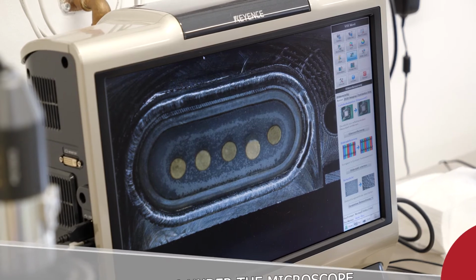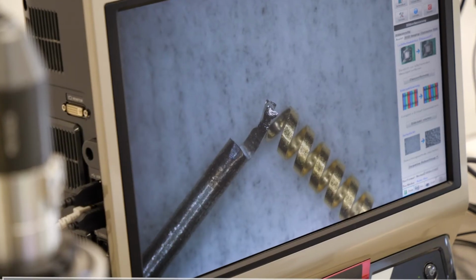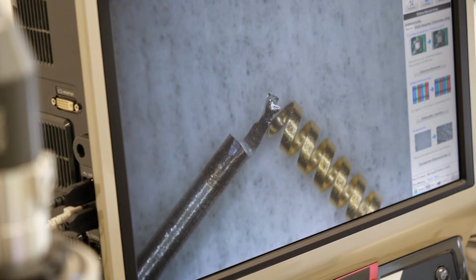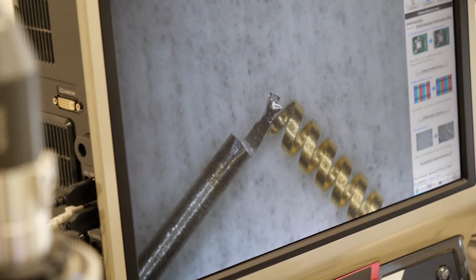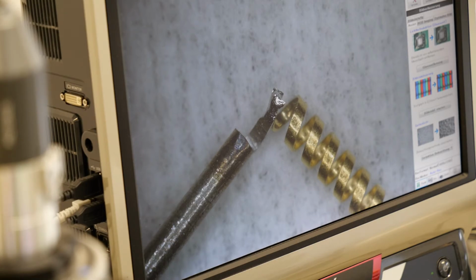That is the welding of this electrical feed-through here. You have the possibility to do a ramp in and ramp out with the power. Here is something tiny. If you look at that, and if you're into electronics or microwave design, it's a platinum spiral which is welded to, let's say, a holder. It's 0.2 millimeters. It's a waveguide tube.